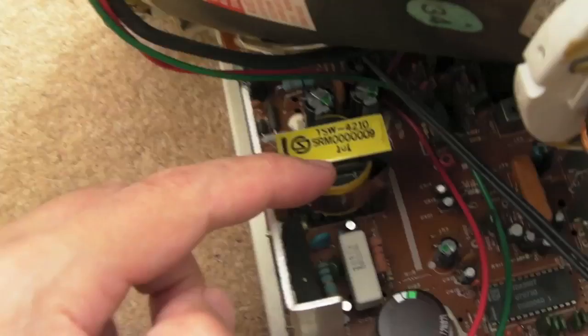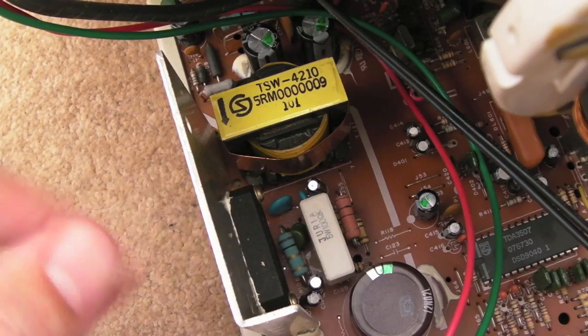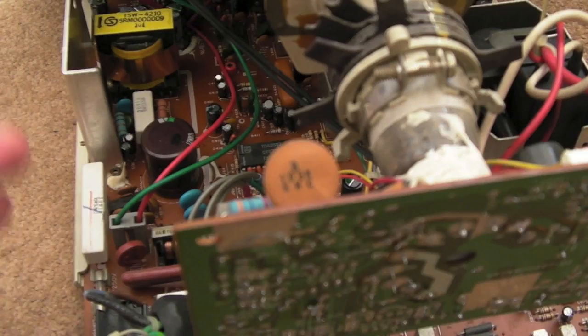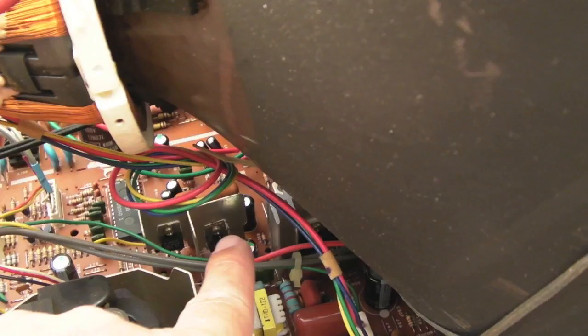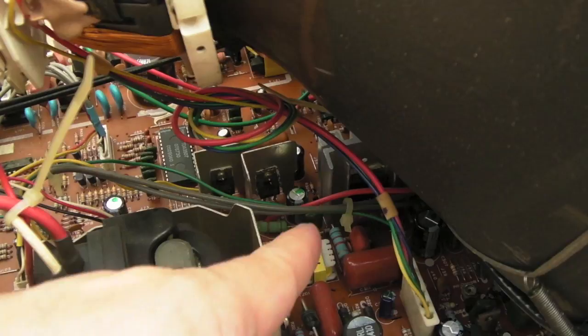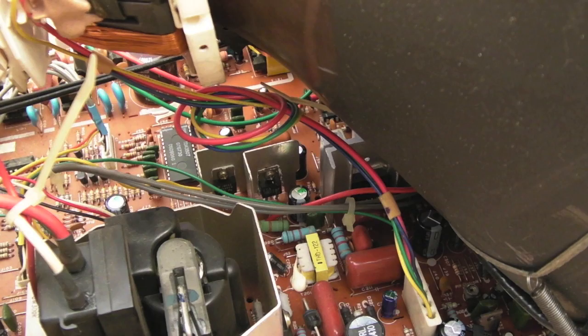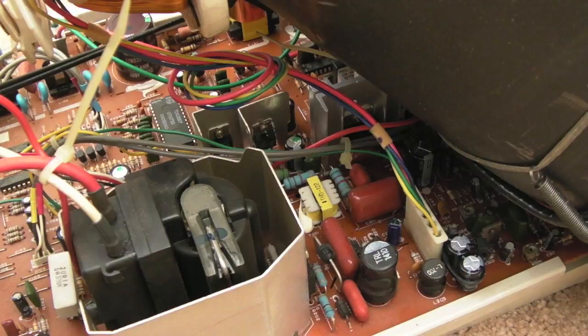I also swapped out the two - in fact I need to put the green dots on - can you see the two down here, 22 microfarad 50 volt, I think they were. Swapped those out - not had any bearing on the colour issue or the initial frequency issue. It could even be a frame - it looks like maybe the frame is just partially collapsing just as it warms up. We could still have something going on down here and I'm not ruling out that resistor. If you remember we found the resistor with some glue that had started to conduct - could be that resistor down there. Down here relates to the vertical deflection and there are still quite a lot of caps around there that haven't been swapped out.